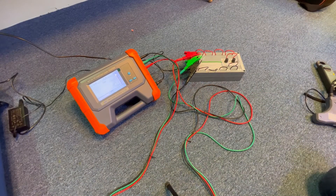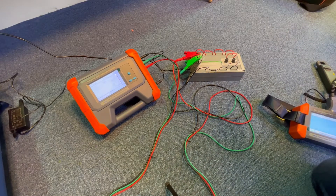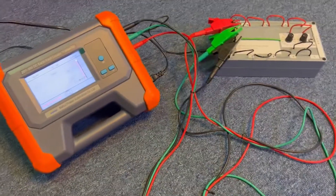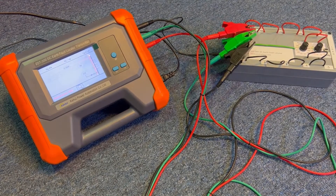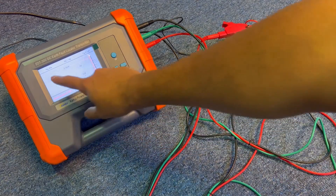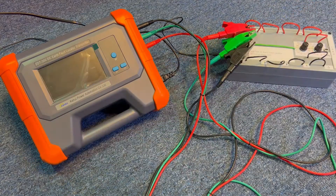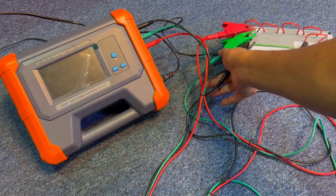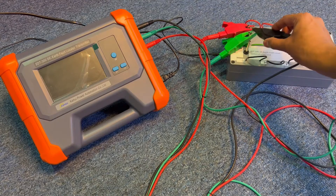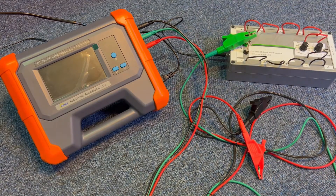This clearly demonstrates how the sensors work in faulty and healthy conditions. This equipment helps you exactly pinpoint and trace a fault without interrupting the DC system, keeping the system stable. For any information, please contact us. One important safety note when switching off: make sure there is no signal injection from the transmitter, then always remove the connections from positive and negative first — touch the cables to ground to discharge any induction — and remove the ground last, then switch off the system and equipment. Thank you.